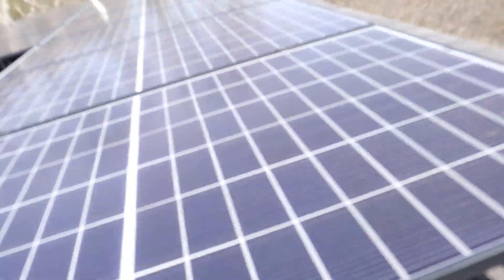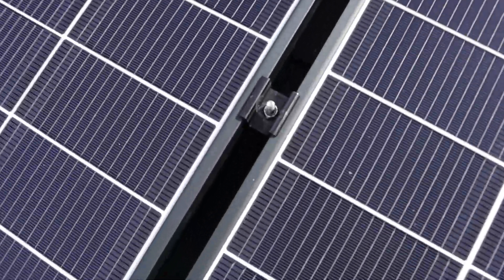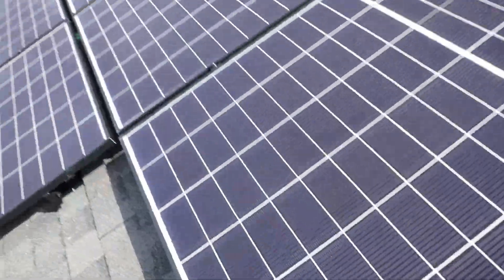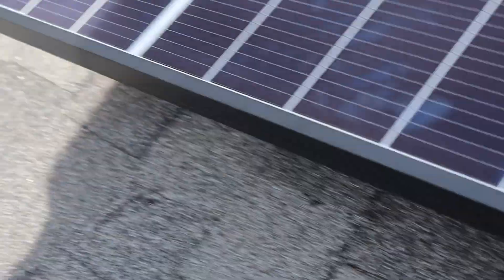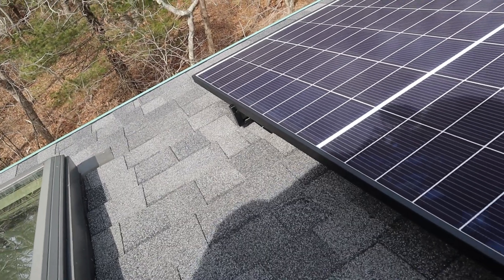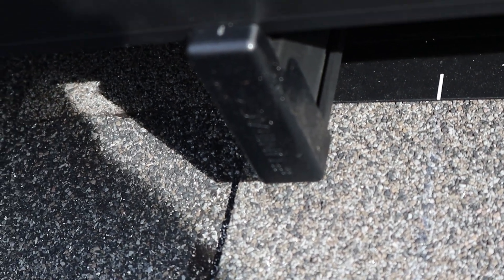As we look under here you want to see nice clear — no wires hanging or touching the roof, anything like that. Nice hidden clamps, so the majority of the clamp sits below the surface of the module. The end clamps cut flush with the edge of the module and do not protrude very far past — just enough to have the plastic clip cover the rail. And that clip, fun fact, is to prevent things like bees from making nests inside the rail. So that is required — it's not just for aesthetics.